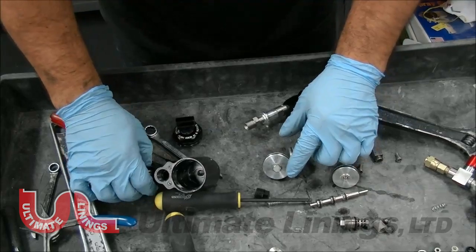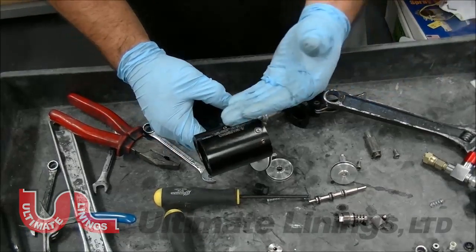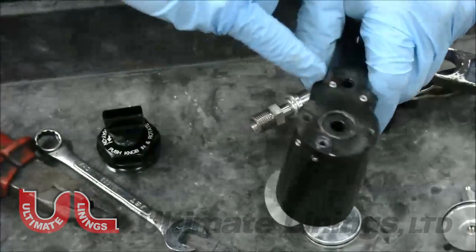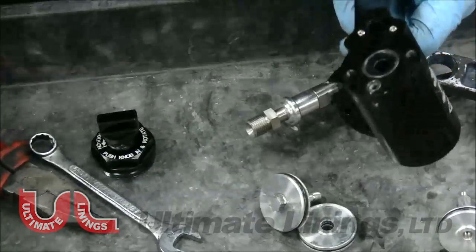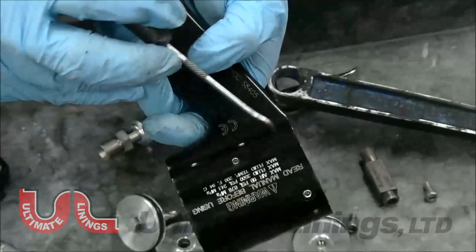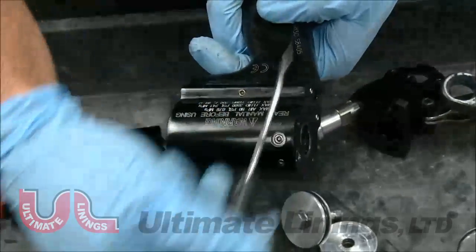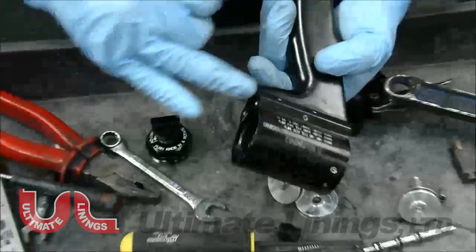When you have a full disassembly, sometimes with overpressure you pull the trigger and material will cross into the gun — that's where the access ports come out. If that happens, do a full disassembly, remove all your set screws, and use a propane torch to heat up the entire gun. The area to really pay attention to is where the port comes down and crosses — that corner is where material builds up. Heat it up well, use a tool to poke out as much as you can, then use compressed air to shoot every single hole.